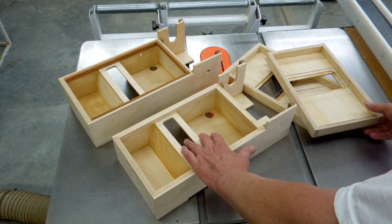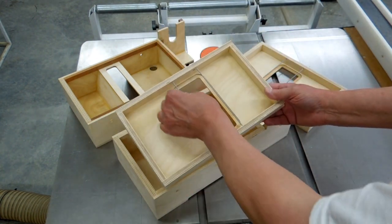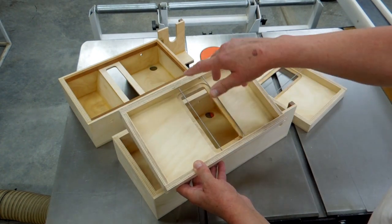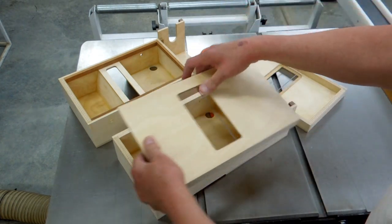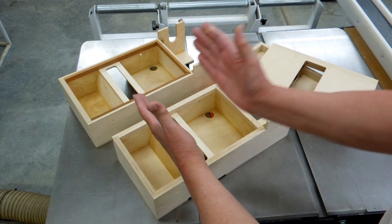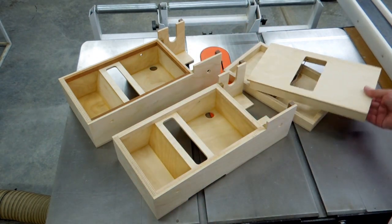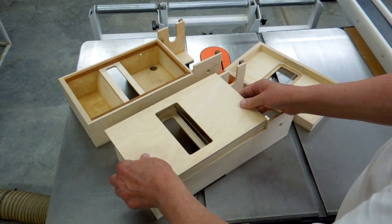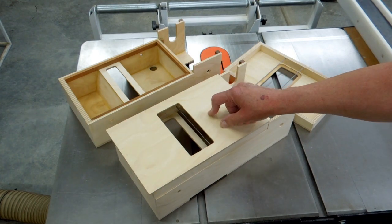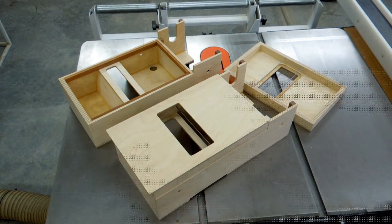Two pressure boxes are completed. The lids are completed. These little wires, you need to try to get those in there perpendicular and parallel. This is what sits on top of the tracker bar and pushes down on either side on the paper so that paper goes over the top of the tracker bar and maintains contact. Probably not all that necessary because the positive pressure inside the box will keep that paper pressed down.